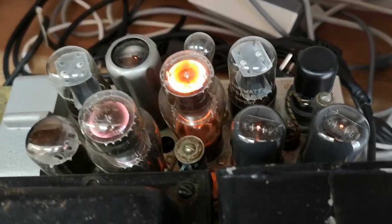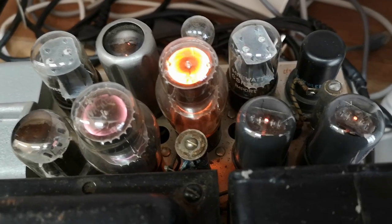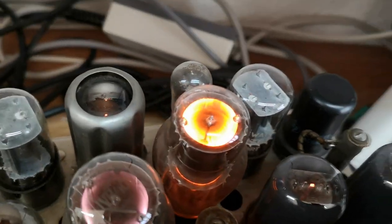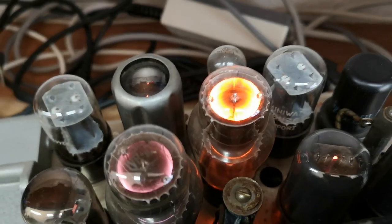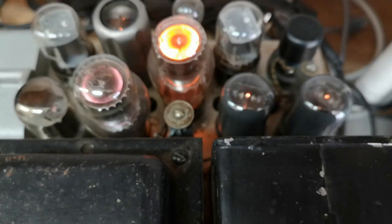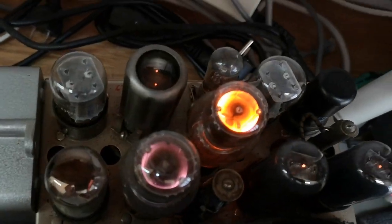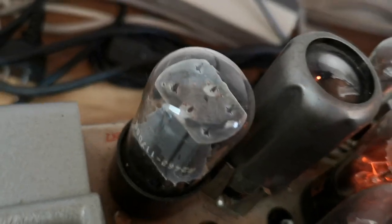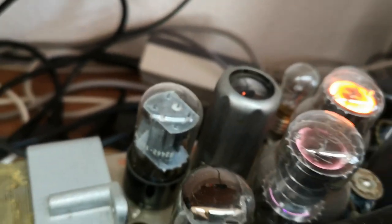The power consumption is 83 watts, including the step-down transformer. This is the voltage regulator — it is very very bright and beautiful. That is one of the tubes. Some tubes show a double glow, indicating a dual-section tube, while a single glow indicates a single tube. This one is not that shiny — you can just barely see a glow on the bottom, really hard to see.